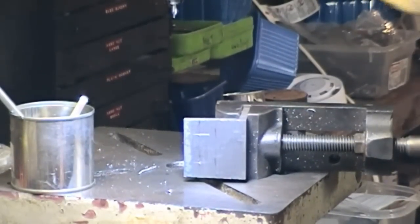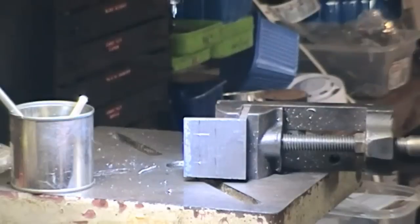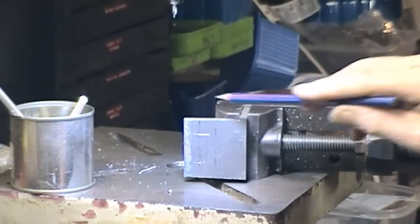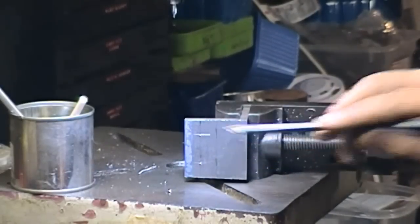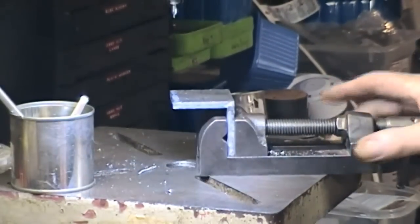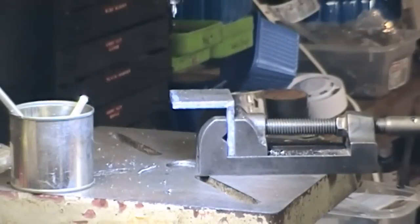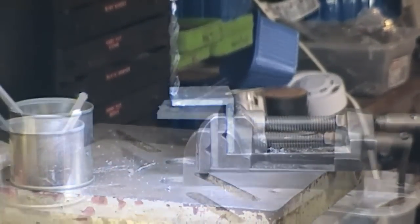Here's the piece of angle I'm using — it's just two inches all round, quarter inch thick. I've marked up centers for the five-sixteenth bolts I'm going to use. I'm going to center drill and then get clearance holes. I won't waste your time on this stage, I'll just show you the finishing bit.